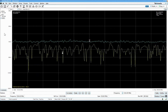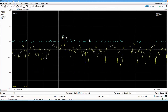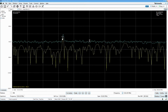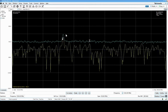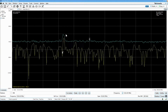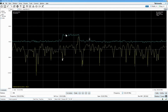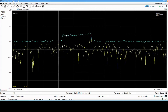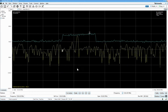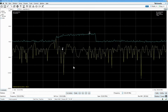I put the RF on and now we can see some RF signal. I'll set this to peak detect. Now I'll sweep through some frequencies — I need to tune the frequency a little bit — and in the end you'll see a kind of envelope as it moves up. We know where the sweet spot should be. Moving around a little bit, you can see the sweet spot is not really here.